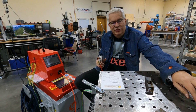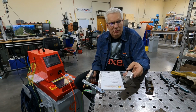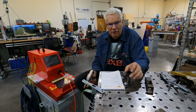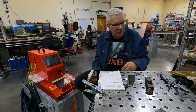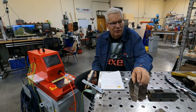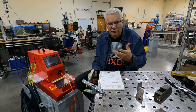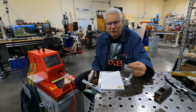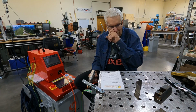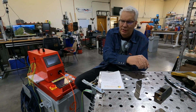And if you're welding steel on my steel table, there's a really good chance you're going to weld your part to the table, which I've done a couple of times. That's why I've got some bumps and stuff over here where I actually inadvertently did that. So I have a little sheet of aluminum that, if I'm going to do something thin like this and I want to make sure it's not welded to the table, I put the aluminum down and weld my steel, and the weld won't stick to the aluminum plate. Okay.